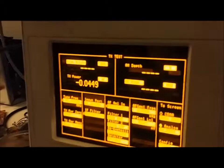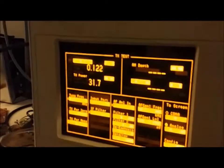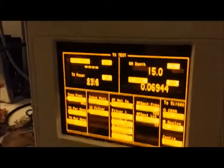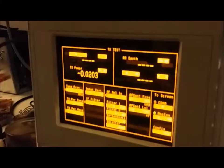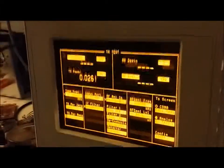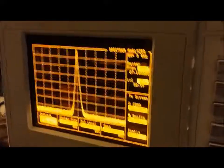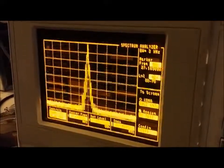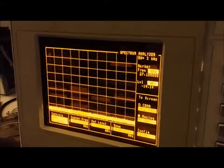Audio audio - about five, swings up to eight on the average side there. Now on the peak power: audio audio, check one two hello - right around 35 watts or so. And here's a nice clean signal now, so all that extra power is actually going to some good use.